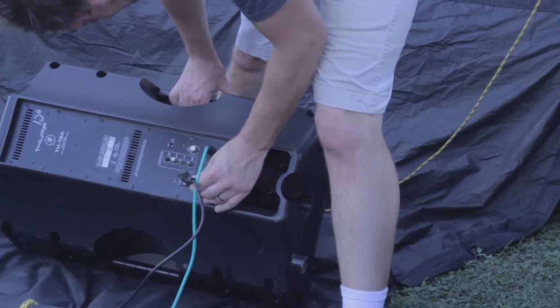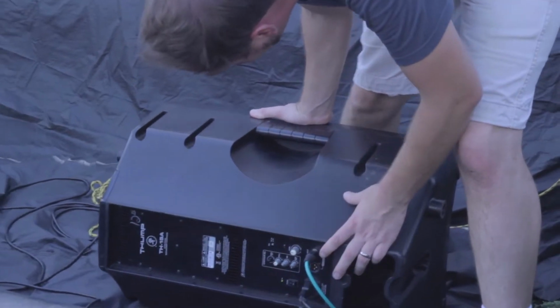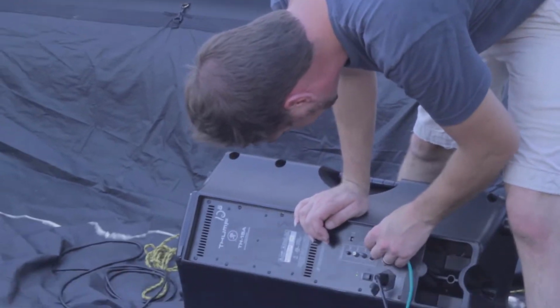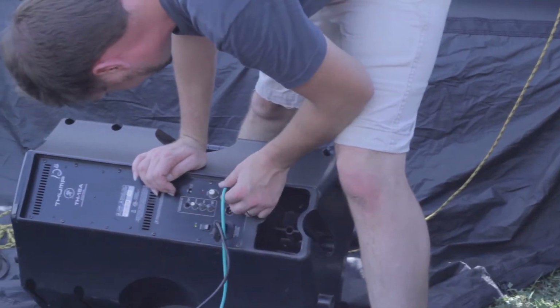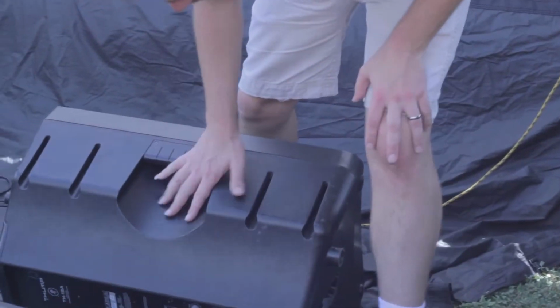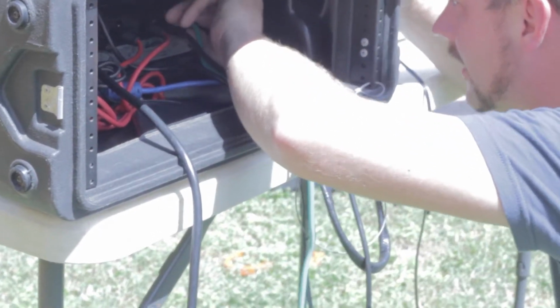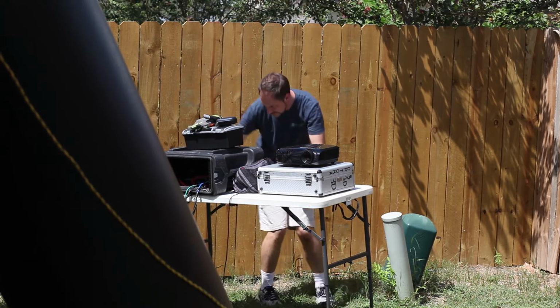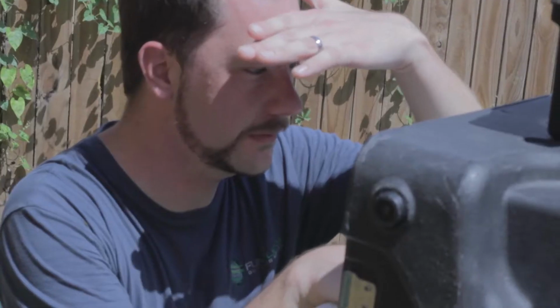I'm gonna troubleshoot that. I don't have anything on this speaker. I have power. I'm gonna check my XLR connection and make sure that my level is turned up. We're good there. So the problem lies back here. Make sure this cable is plugged in well. Main out left, yeah, it's secure. Looking up front, I see signal there on channel 3 and 4.